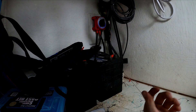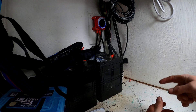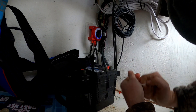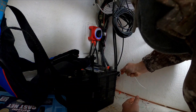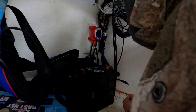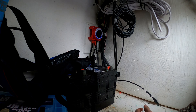All right, there's my string. I'll hook the end of the cable into this, and I'm gonna run another rope on there through here in case I need to run anything through in the future. It was a pain getting the fish tape those last couple inches. No wire on the string, so I'm gonna pull this stuff through. Wires are through! I ran a second string through here that we'll just leave in the rigging tube in case I need to run anything in the future — handy to always have a string in there.